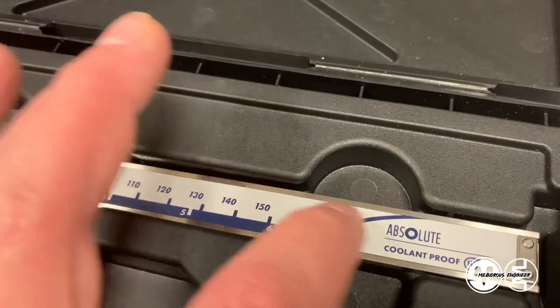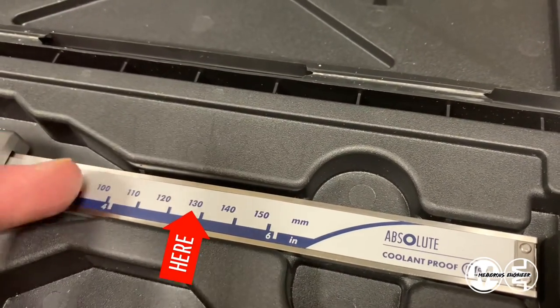Some people jokingly call the digital calipers cheater calipers. And, you know, take it or leave it, they're actually really great for converting imperial to metric really quickly. And so that's some strength that they have. And you don't have to think about where the dial's pointing and actually understand what you're reading on the calipers themselves. So it's not that bad. The housing itself is what makes them cheap. So the magnetic reader within the calipers themselves can degrade over time if it gets scratched or ruined.